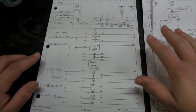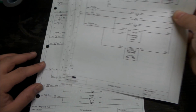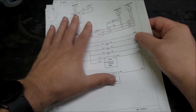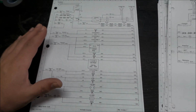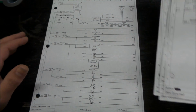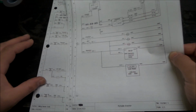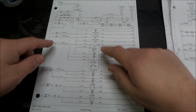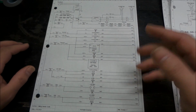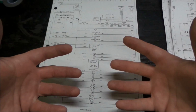Designing things isn't overly complex. It starts to look it after a while, but really the fundamentals are all still this. And then it builds upon that. It just kind of gets refined and cleaned up. We go from the idea of a basic inverter in a box, and we end up with protection fuses and diodes to help protect the switches, and cooling fans, and all that other stuff. It just got built upon from there.